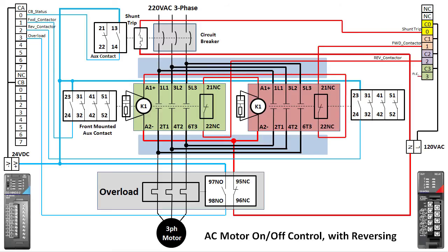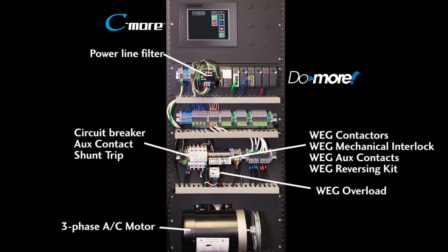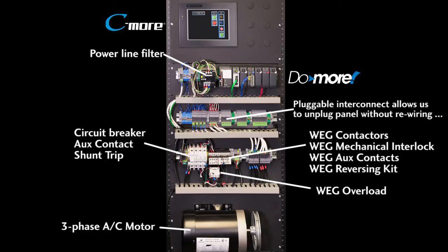It provides an extra layer of protection, and having both electrical and mechanical interlocks is required by some codes. And there you have it — a full reversing AC motor start/stop control circuit with the ability to remotely trip and monitor the breaker, remotely monitor the overload, electrical and mechanical fail-safes built in to protect us from wiring shorts if the controller accidentally tries to engage both contactors at the same time, and overload protection. Keep in mind that while we didn't show it in the simple wiring diagram, proper grounding and wiring in accordance with the National Electrical Code is assumed. Here's a photo of the test rack and all of the parts used in this video — there are extra wires and connectors so we can swap out controller and subject matter panels for other videos, but functionally it's identical to the wiring diagrams we created here.